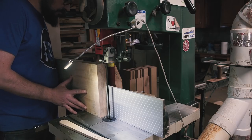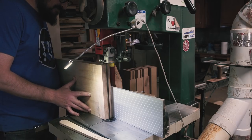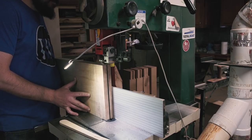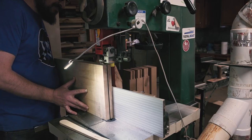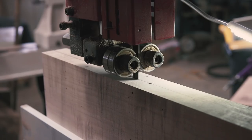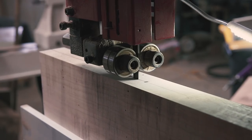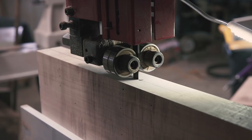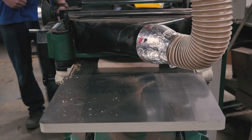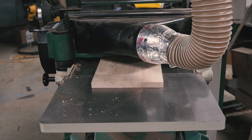I went to the lumber side of my shop and picked out some short drops of 8-quarter material. I decided on using a piece of 8-quarter curly silver maple, and since I didn't need a 2-inch thick clock, I re-sawed it in half, taking it nice and slow on my well-tuned bandsaw. After planing the saw marks off, I ended up with about a 7/8-inch board.